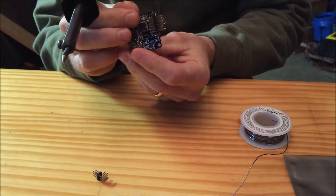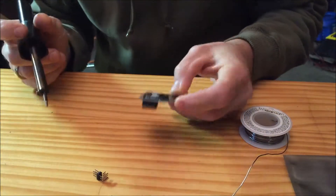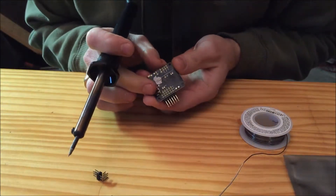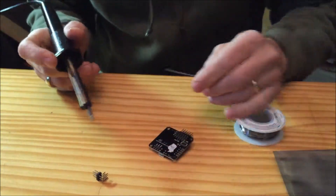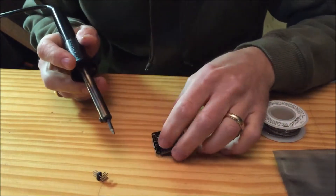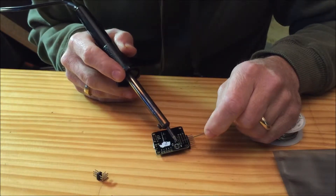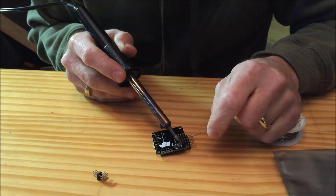That's not bad at all. So I think I'm going to go with that. All we have to do is continue on with the rest of the connections. I want to make sure that when we do this we're not overheating it, but we also want to make sure the solder is flowing through — because this is a two-sided board, we want to make sure it's flowing through to the other side.